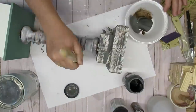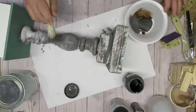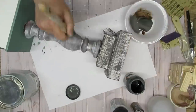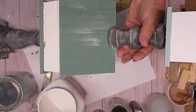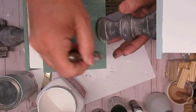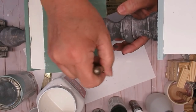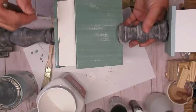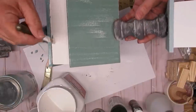I decided the gel stain was a little too brown — I'm trying to stay away from browns — so I'm going ahead with some dark gray chalk paint over the white, which just helps to make it look even more old and weathered. I also took some of the gray and went over the white on the candlestick to add a little bit more dimension. Since everything on this piece is distressed I also had to distress the rooftops — just taking a small chip brush with a little white chalk paint and dragging it from top to bottom. I am head over heels for this birdhouse topiary!